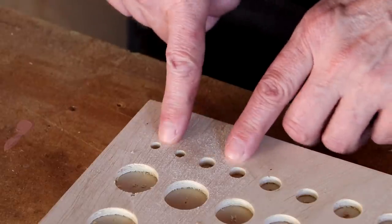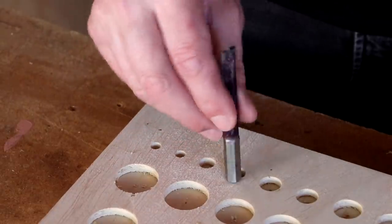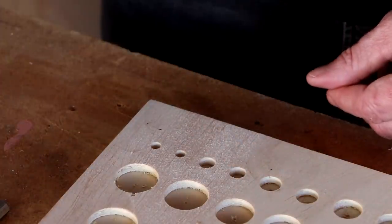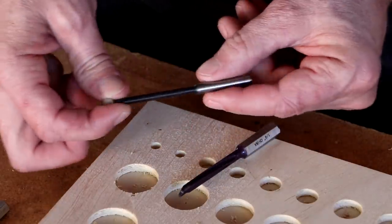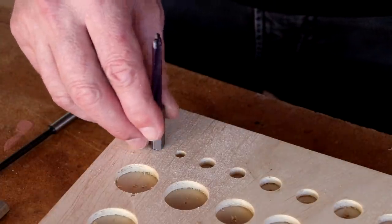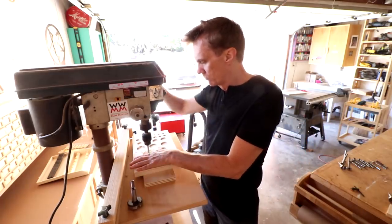These last four are going to be a little more challenging. This 3/8-inch bit has a head the same size as the shank, so it's the same size as the hole — it'll just drill all the way through, so I might have to figure something out. This other 3/8-inch bit has a thinner shank, so I can still use the same method of supporting it. On the quarter-inch ones there are a few different shank sizes. The five largest bits have a 5/8-inch shank, so I'll drill those out first.